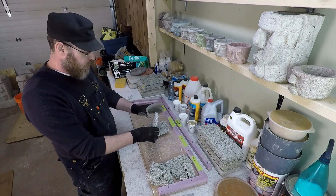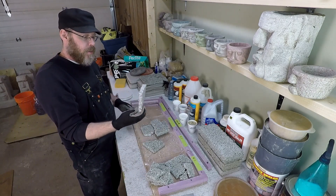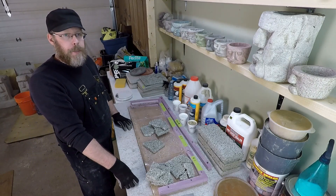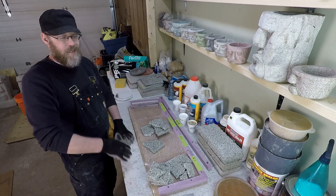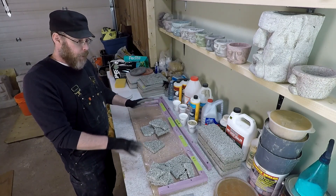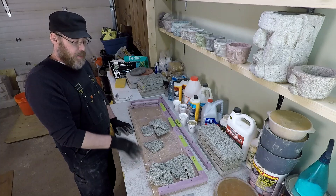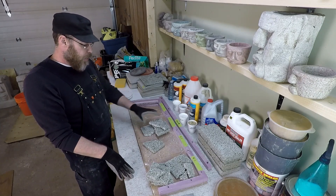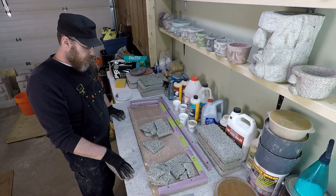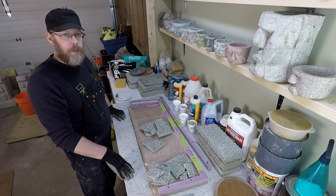You can see why you wouldn't build a house foundation out of four-to-one perlite concrete. The best lightweight concrete mix really comes down to your application. If I'm building a pizza oven to cook food in, I'm probably not adding chemical additives — just perlite and cement or vermiculite and cement depending on your application. Be careful with your ratios because you give up a lot of strength moving toward lightweight concrete recipes. If you found this information helpful, please like this video and subscribe to my YouTube channel, and check out swimmingpoolsteve.com.